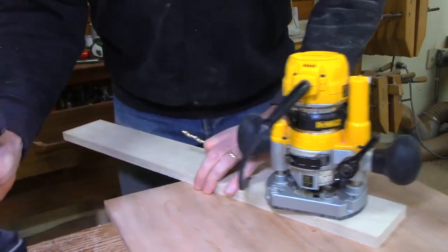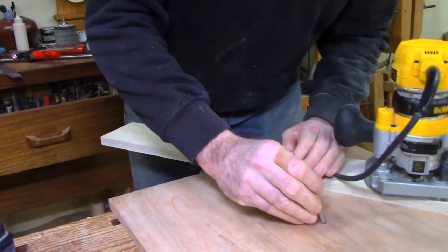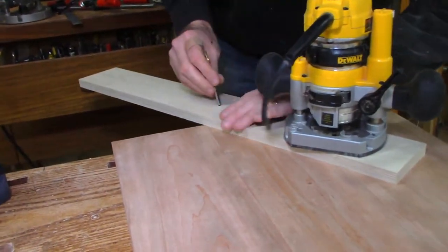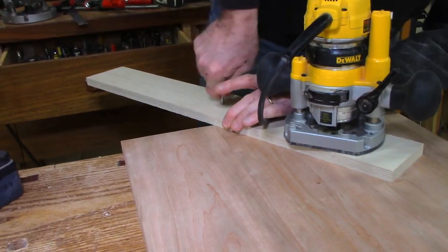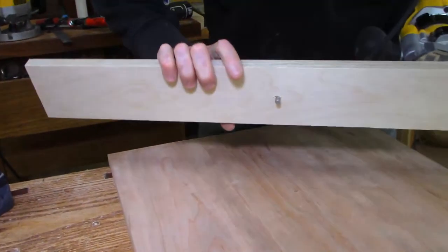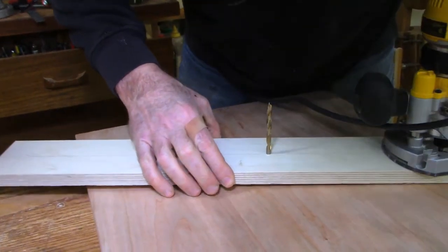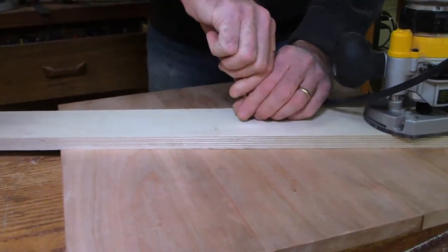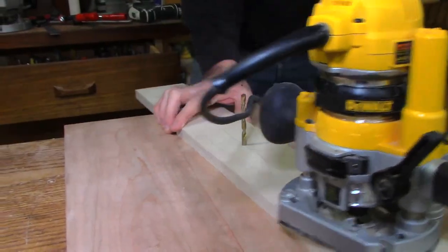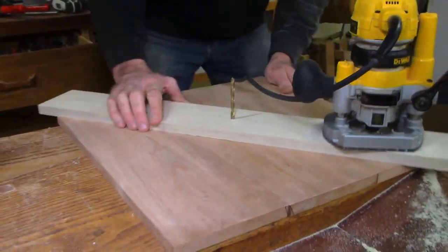I don't want any play in that, you know. And let me make sure it fits in here. Yeah, perfect. Okay, so for some reason it was binding in this. There we go. It's the perfect pivot. So there it is, sticking out there. I'm going to just get it right in there. And now look at that. We've made ourselves a beautiful circle cutter right here.